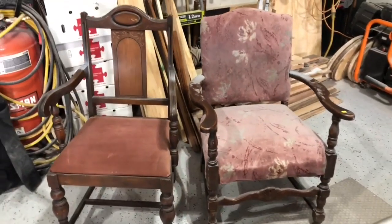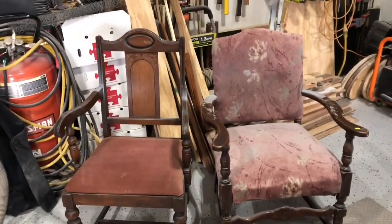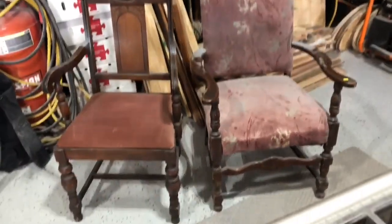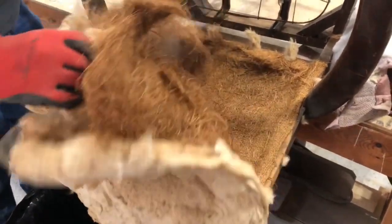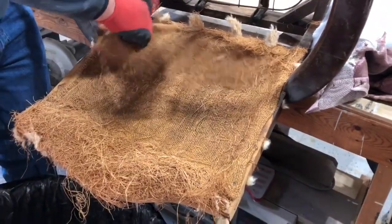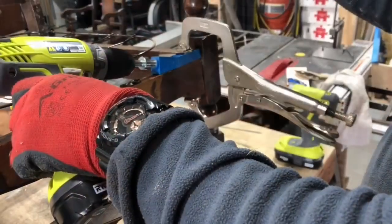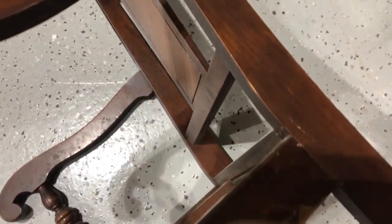The chair on the right I picked up for $5 at my local Goodwill, and the chair on the left was part of a haul from a friend who bought a warehouse full of furniture pieces. As a flipper, when I reupholster any furniture, 99% of the time I don't keep anything that's fabric — I take everything off. You can see how old the first chair was. Both chairs were quite wobbly, so Chris used a Kreg jig and tightened up all the joints by slipping a screw in. Then I gave the chairs a good once-over with the orbital sander to make sure there were no big deep gouges in the wood.